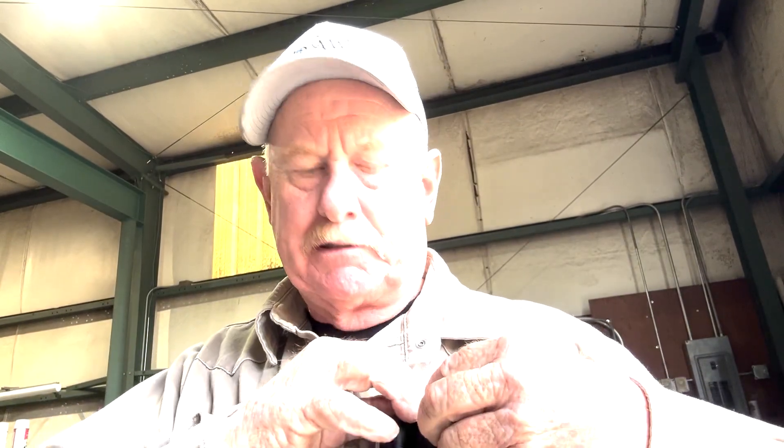When you do have one side cutting just a tad longer, mark it, look down in there to see which side's cutting, mark it, take it over to the grinder and hit that side right there. You've seen just how much I hit it, and she went to pulling double curls out of it.